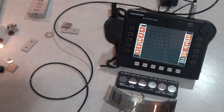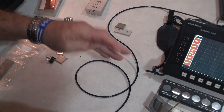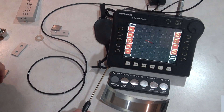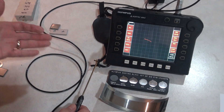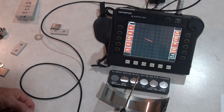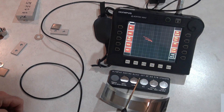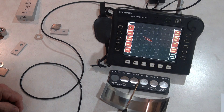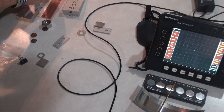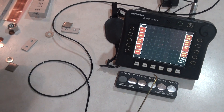I'm going to null it one more time and just for fun look at some other materials. My gold ring has a pattern that goes off to about 9:30, and looking at materials close to that, copper nickel is pretty close - it's between magnesium and copper nickel. But I presume this is not copper nickel; if it is, I paid a lot of money for an inexpensive material! This really shows how important it is to have standards that you can use for comparison.